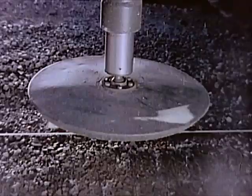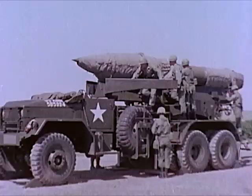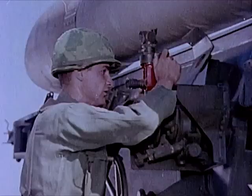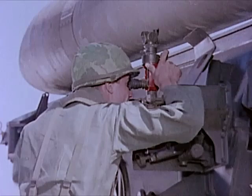The launcher is stabilized with three screw-type jacks and can be cross-leveled to compensate for cant. The beam assembly is extended for firing at the firing position, locked, and the blankets removed. The rocket fins are attached. Sighting and laying procedures, including bore sighting and the use of a gunner's quadrant and panoramic telescope, are like those used with cannon artillery.